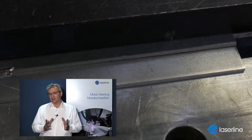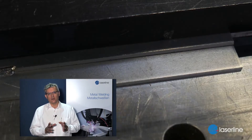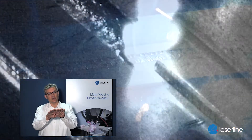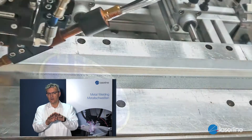One quick word up front: we are often asked about brazing versus welding, and there seems to be a little bit of uncertainty sometimes. For us, welding means I'm melting the materials to join, and then after re-solidification I have a joint part. So I have two parts, put them together like here in the butt weld, melt both of the partners, and after re-solidification I have a welded part.